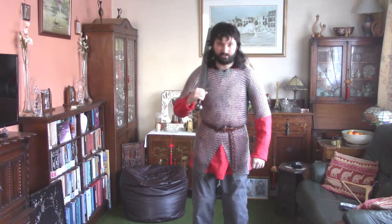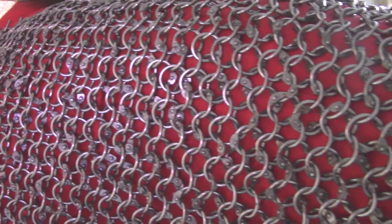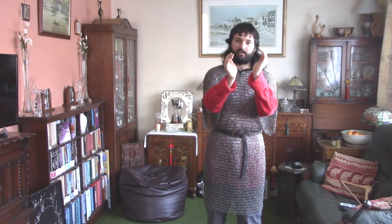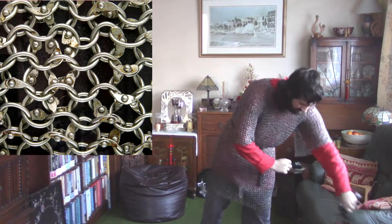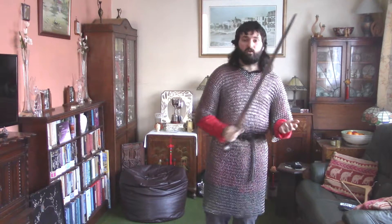So let's have a look at something a lot more authentic — riveted mail. It's a lot more authentic. I'll give you a close-up. On quite a few of the rings — well, all of them — you should see what look like little blobs or dots. Those are rivets. Rather than butted mail where you've just got it opening and closing on itself, it actually overlaps slightly, there's a hole punched in the middle, and there's a rivet which secures it closed. This is significantly tougher — at least triple the strength of butted mail, probably more. If you look at medieval artwork and actual finds of medieval mail, they all show that it is riveted.